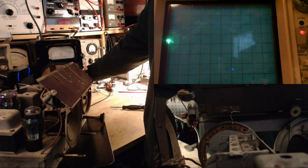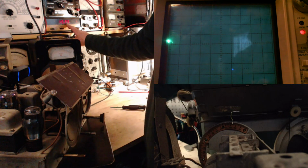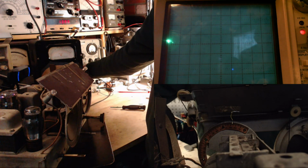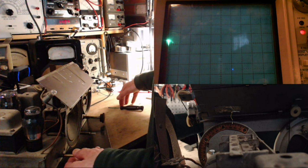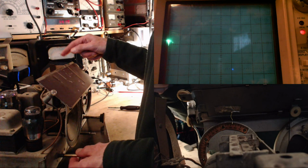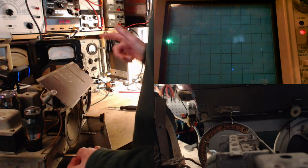Nobody's home. How can that be? .26, I hear it. That's a little weird. That's really very strange that I can't. Oh, right. So I'm connected to the shortwave antenna, and if I remember right, the shortwave antenna is shorted when I'm in AM. So I'm probably not feeding any signal in.